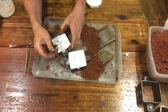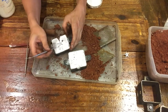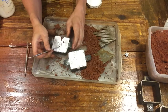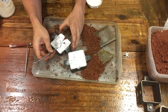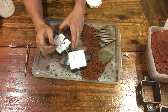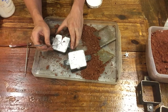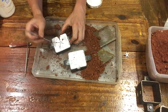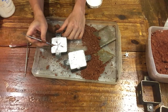And it's important to just gently press and pull out. What you don't want to do is what happened here with the slight shift, because that'll leave more sand texture. So just gentle pressure and pull and a gentle lift, okay? And so you can cut those lines as deep as you want, and generally, if it's a good casting day, you'll even see where they were. And if it's not a good casting day, you won't know they're there, but your part will be perfectly fine, okay? So there we go.